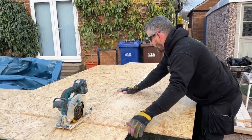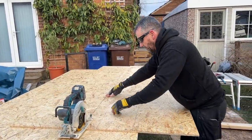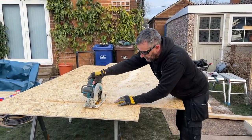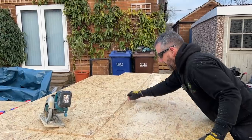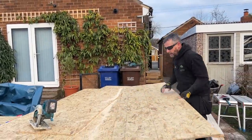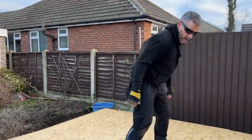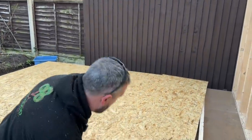We're not looking for perfection on that cut because the 90mm just hangs over — but don't forget we've still got 11mm thickness of OSB so it's not going to protrude past the back wall. I've just set the saw blade fractionally deep so it's scored through that board but the board is still usable — we've created a little table for working on. I'll now get it into place and start nailing it, then show you the overhang.